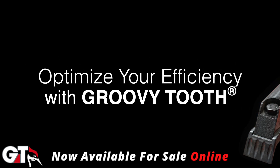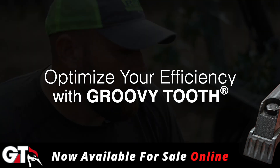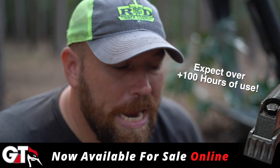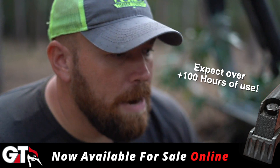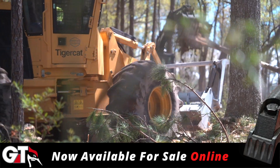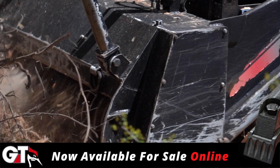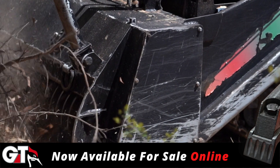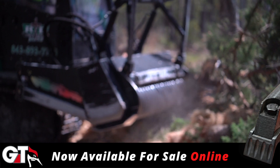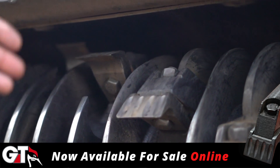That tooth saves a ton of time and a ton of stress on everybody operating these machines. We've probably gotten 160 hours out of a set at best; you're going to average about 100 hours out of a set — that's what we've seen. And even on this larger 250 horsepower machine that is spinning the drum hard and hitting bigger material — much more likely to chip or break a tooth — this has actually shown that we can get plenty of hours out of the teeth on this drum as well.